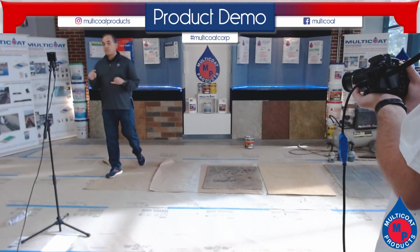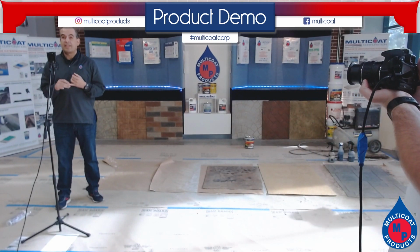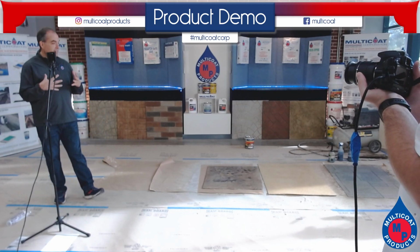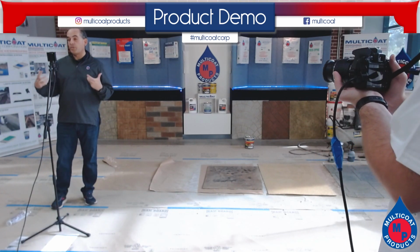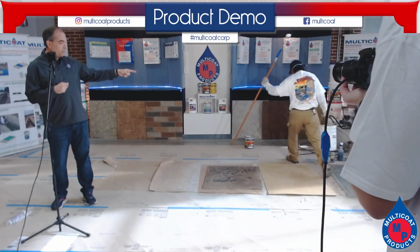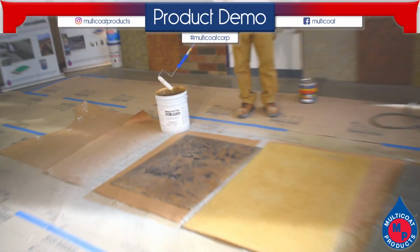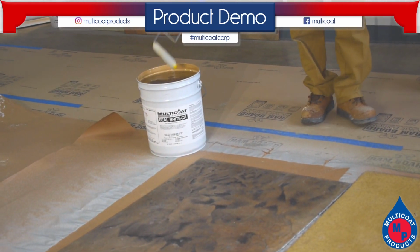The other 2 sealers we're going to show you are our solvent-based Seal Bright sealer. It's a silane-based sealer. It's not lacquer-based, and the beauty of it is that it won't yellow with UV issues, and that's what Alfonso's going to put first. Is our Seal Bright solvent sealer. We make this product in 2 types. We make one for California because of California rules, and then we make one for the rest of the country.